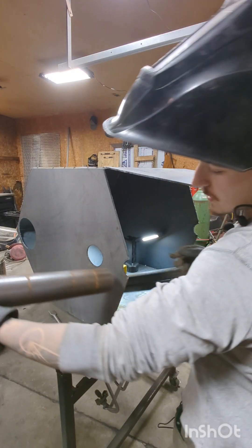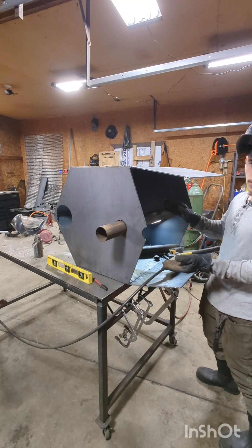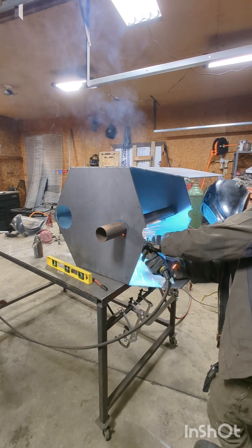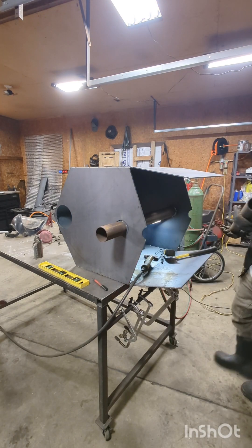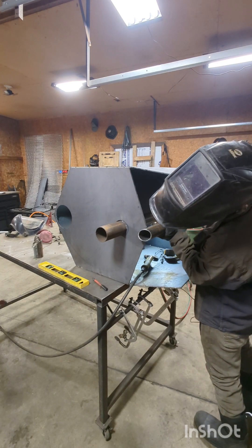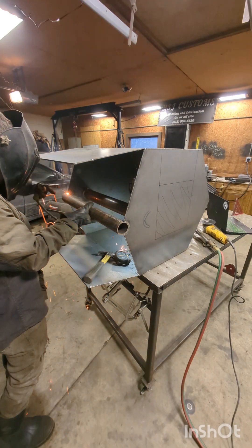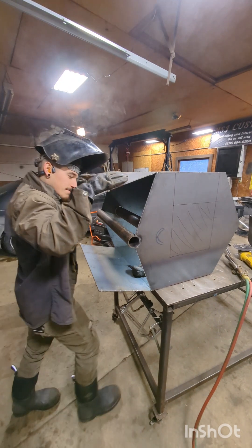I'm going to begin with the inline blowing tube, and I position the vents so it's pointing up into the sidewalls of the stove. I'm going to weld the bottom now — once I seal this thing up I won't have any access to it. Now I'm going to put in the ash clean-out tube, positioned so that the back cut we made is angled down to me and the face of the two-inch pipe is on the face of the outside shell. Now that I've got this welded in on the backside, I'm just going to fold down these flaps.